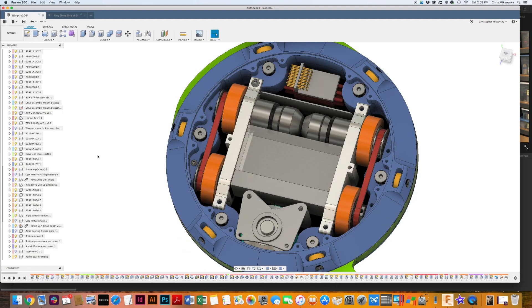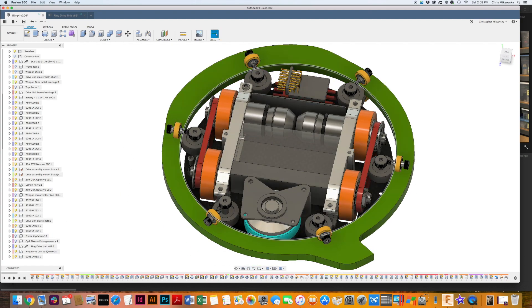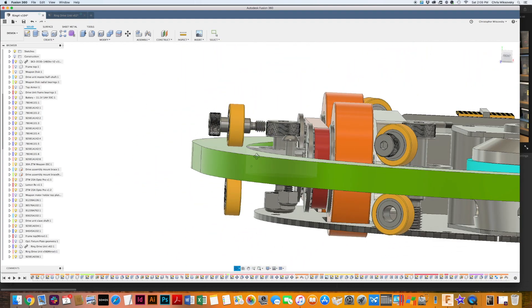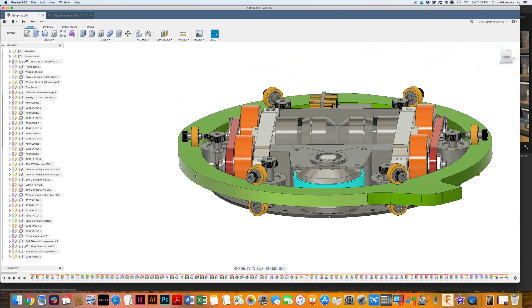I can show you how the ring is being constrained. There are 18 ball bearings holding this ring in place, constraining it so it can only rotate — it can't move up, down, or side to side. There are six 19mm urethane-coated bearings and twelve 11mm urethane-coated bearings — six on top and six below. The 19mm bearings constrain it radially and the 11mm bearings constrain it axially, so there's just the tiniest of gaps.